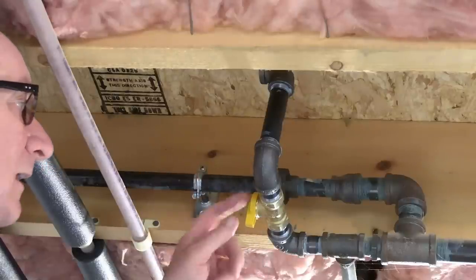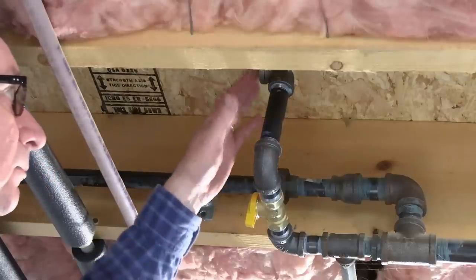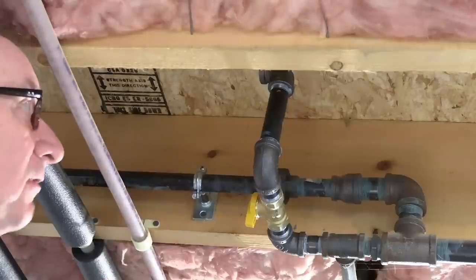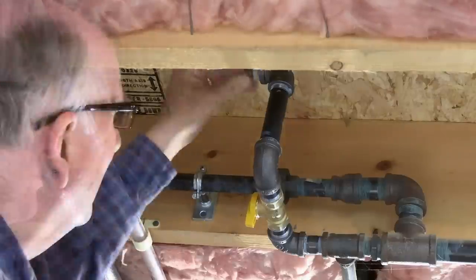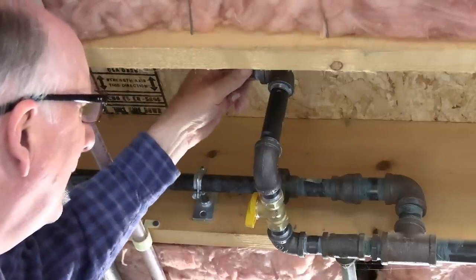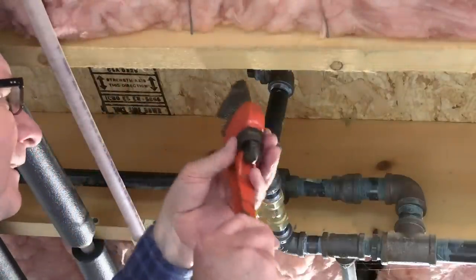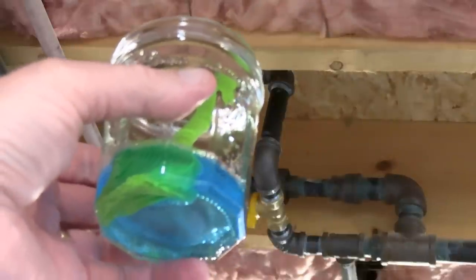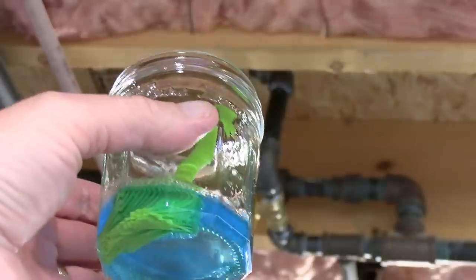I have this valve — I can shut that off and turn on the gas on the outside. I can put a plug here if I want and basically put the house back in operation while I get my hole cut out of the sill. Here's my solution of detergent and water — it's 50/50. I use about a tablespoon of each and a little brush; I'm going to paint that on all those joints and see what happens.